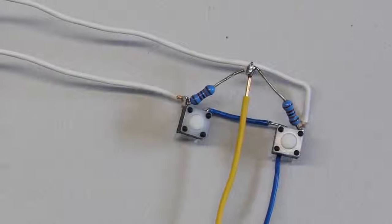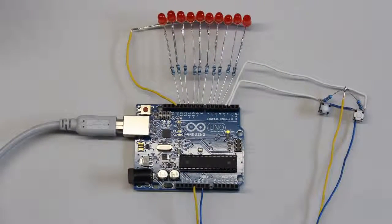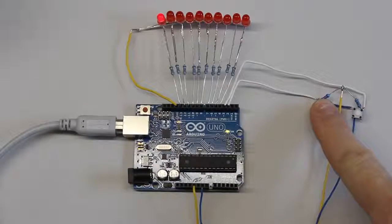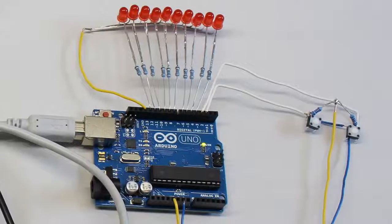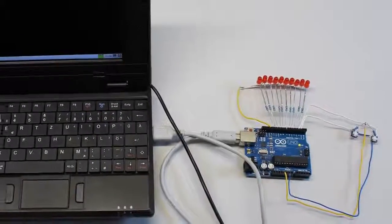A keyboard consists of multiple keys, which are nothing but push buttons, whose state can be read through input pins. The LEDs are operating as computer screen, indicating the state of a push button. Whenever one of the buttons is pressed, the associated LED is lighted up. Well, something like that can be done even without a microcontroller. Without modifying the wiring, but by loading a different software, the mapping between a button and an LED can be altered.